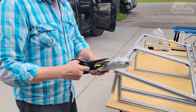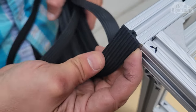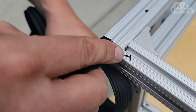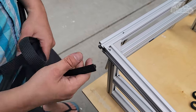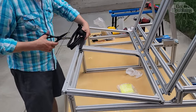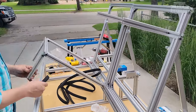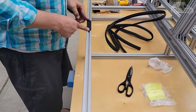This is a gasket — I decided to give it a try this time too. It slides in there like this. This goes into the groove in the 80-20 and creates a seal — it slides or pushes in like so, creating a rubber seal there. I'm going to put a few lengths underneath these points here. What I want to do is cut and then place. And yeah, it just pushes in easy.